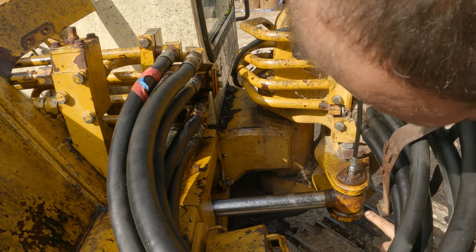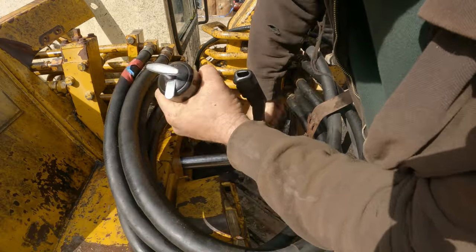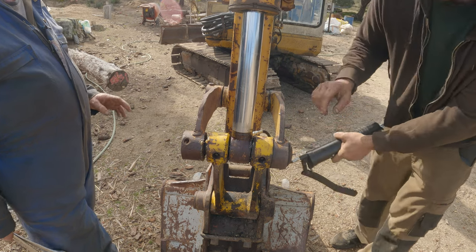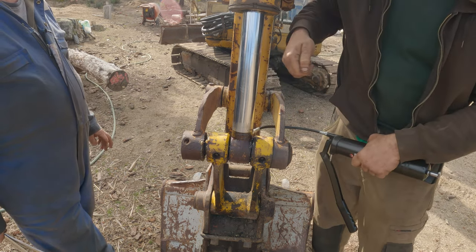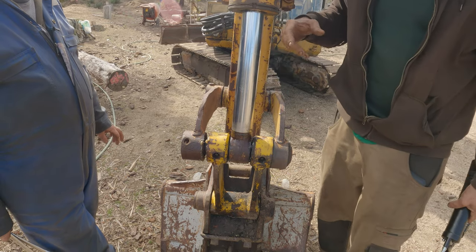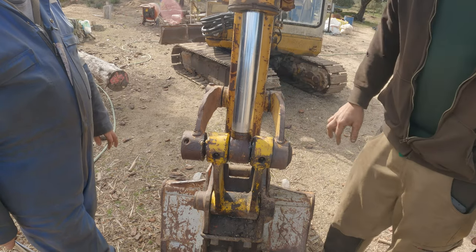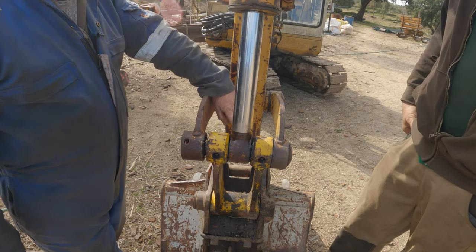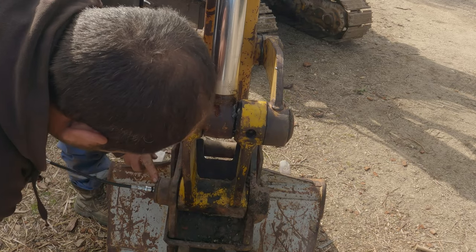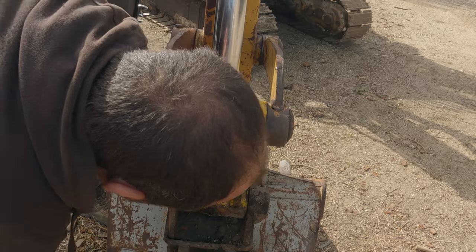You can see the grease just came out of there — that means it's well lubricated. But this one here is blocked. When a grease nipple is blocked like that you have to undo it with a spanner like the other two, then put WD-40 in it, or you can heat up diesel if it's really bad. Safety first — try WD-40 and if that doesn't work, buy a new grease nipple. If you find the grease gun end won't connect at all, it's probably just grit in that little recess — get a small screwdriver and scrape it out.